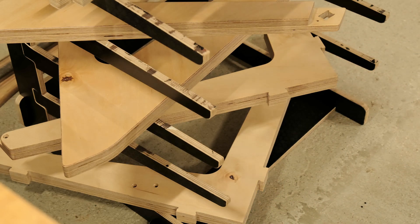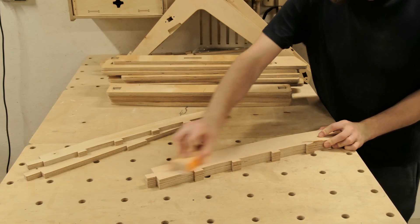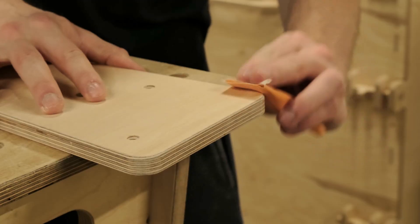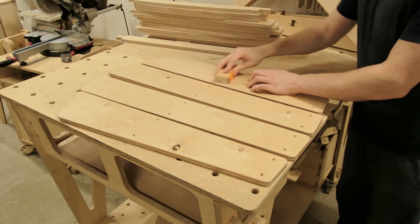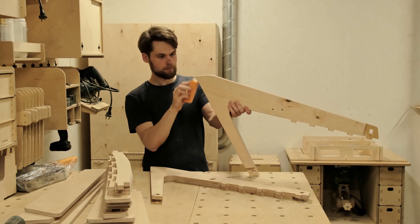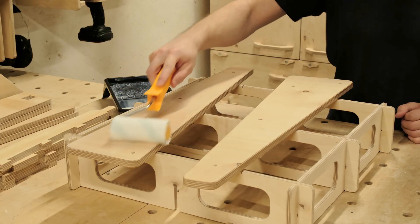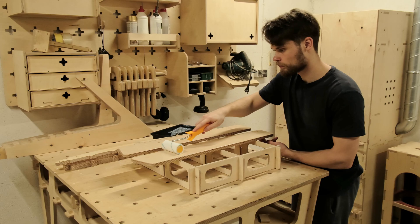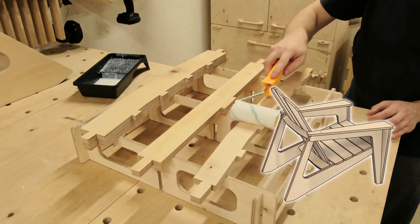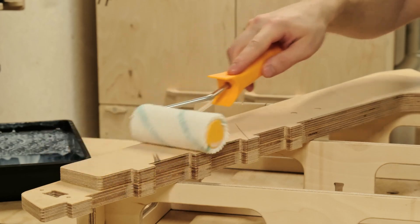After we have applied the first coat of finish, we can re-sand the surfaces with a finer sandpaper and apply the second coat. You might have noticed that we are also finishing the joint tenons, so it is a good time to talk about the joinery. Since one of the criteria when designing our chair was to make it in a way that allows us to take it apart, we decided not to glue the parts together but to use fasteners instead. So in our case, the tenons and mortises serve mostly for aligning the parts during assembly, meaning the finish on the tenons won't affect the structural integrity of the build. We also designed an Adirondack chair option that requires gluing the parts together, which has larger tenons and mortises to increase the glue surface. Small details like these matter a lot.